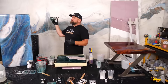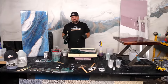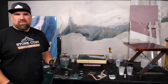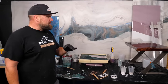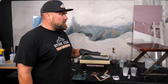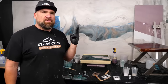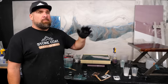Question: 'What kind of epoxy do I use for a half-inch pour over coins?' Half-inch is almost too small for casting resin. If I had a table with pennies on it and wanted to fully encapsulate them, I'd start with a coat of epoxy or super glue to glue the pennies down, fill them up to just below flush, then pour another coat over them. The little valleys of the pennies will show if you just full-send it. Do it in two pours — bring the level up to just over the pennies, sand it down as smooth as you can, then pour another coat.